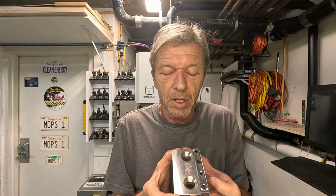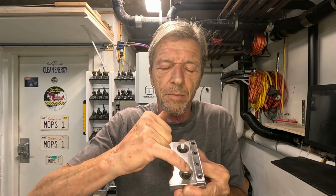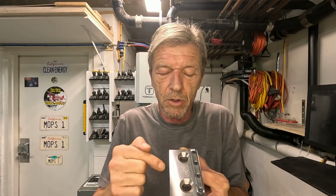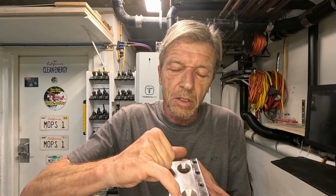And when I tried different things, it always came up with very awkward tool paths, especially if you cut this slot before you taper this. It creates very awkward tool paths. So what I did is I first taper these openings and then do the same taper on the back, and when everything's done, then I cut in the slots. Because then in Fusion I can just taper that, have a circle on top of here and the circle at the bottom of the taper, and that creates a very clean and fast toolpath, and then I cut in the slot.